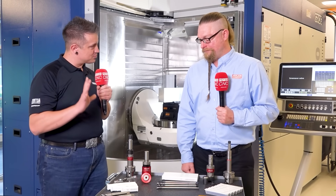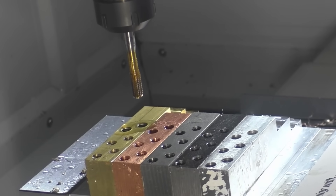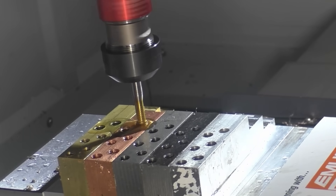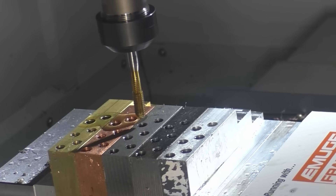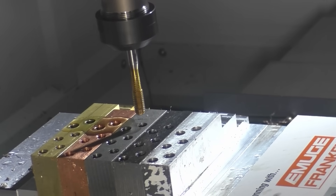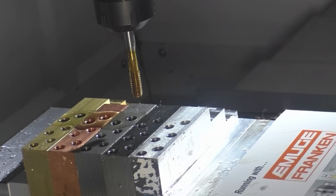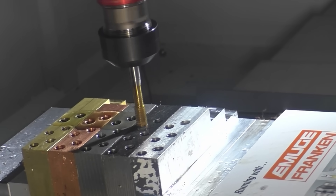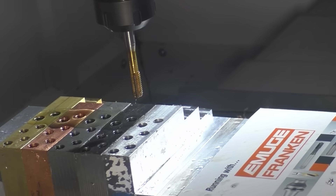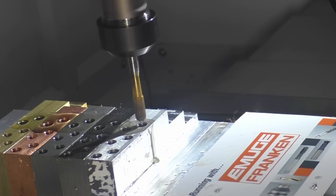When it comes to materials, what material range can I run these multi-taps in? Successful tests have been run in soft mild carbon steels, alloy steels, and hardened alloy steels as long as you're below 38 Rockwell C scale — the multi-tap can work well. Also your soft gummy stainlesses, your 300 series, your austenitics, as well as hardened stainlesses — for hardened stainlesses you want to stay below about 36 Rockwell C scale. And also your non-ferrous alloys: brasses, coppers, and aluminums. This tap works in a wide range of materials.